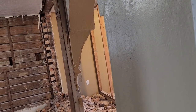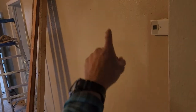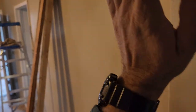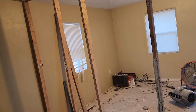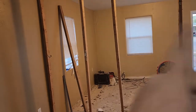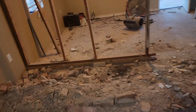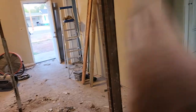All this adobe — my plan is to get rid of it. This wall right over here in the living room, I plan to take that all out too. I believe this isn't a load-bearing wall, but I'm not 110% sure yet. If it is, no big deal — we'll go ahead and put up a temp wall to take the load and support the ceiling. We're going to try to do that wall after we get this wall here built and that wall taken down, so we don't have too many load-bearing walls to deal with at once.